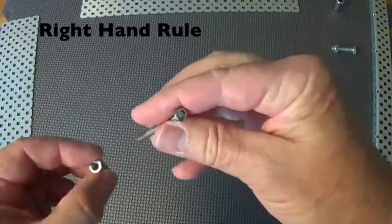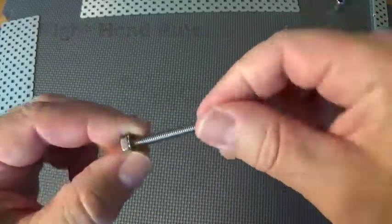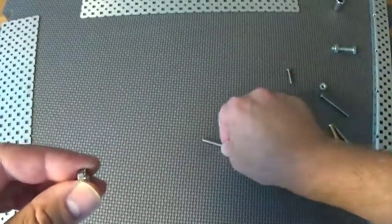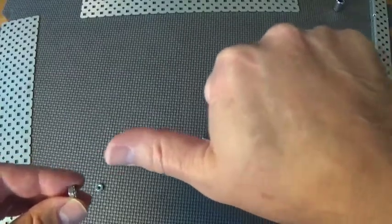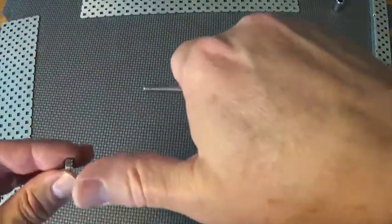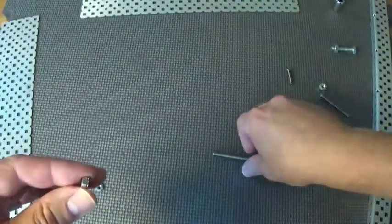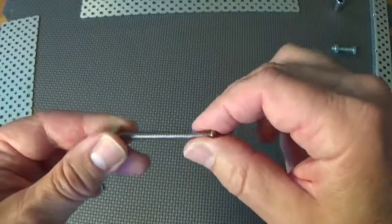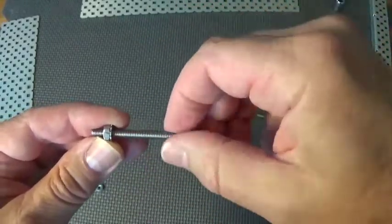As for getting a nut and a screw together, a lot of kids have trouble figuring out which way to turn it. There's something called the right-hand rule — it's pretty simple. The direction you want something to move in, you start with your right hand. Point your thumb in the direction you want the thing to move. So if you want the screw to move toward the nut, your thumb points that way, and your fingers then point in the direction of rotation. A lot of threads in this industry are right-handed threads, so you use the right-hand rule to drive it in.